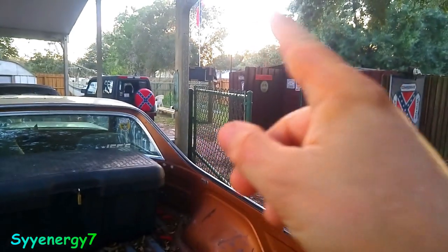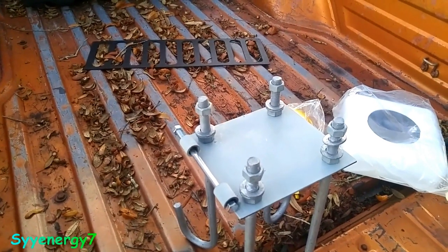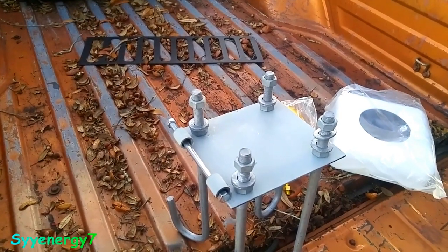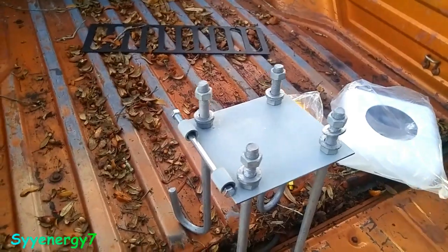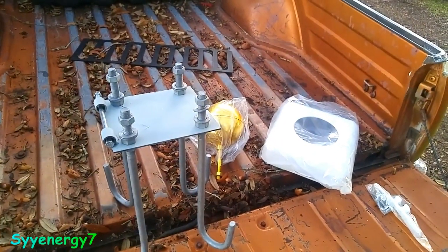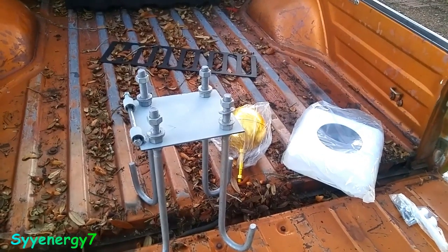The hinge direction means I can bring the pole down from here to there. If something gets jammed on the upper pulley, or something happens with the halyard — the rope that raises the flag — I can fix it. That's why I like this. The pole only weighs 96 pounds, can handle an 8-by-12-foot flag with 100 mph winds with the flag up, and 140 mph winds with no flag.